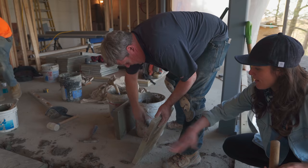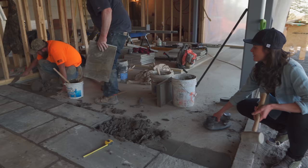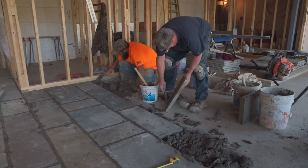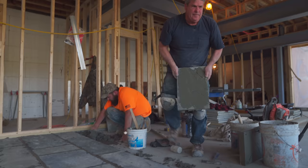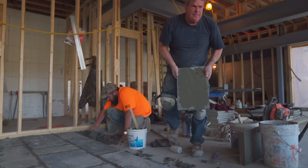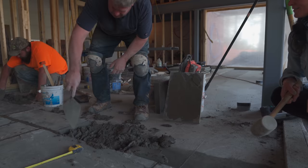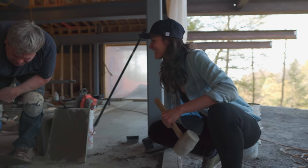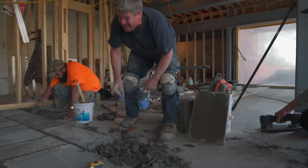Wetting it on the bottom allows it to bond — if you lay the stone nice and dry, it doesn't bond as well to the mortar. What I do is take Portland cement and add it to the water, make a paste — it works great as a glue. I love this tool because it gives the stone a handle to work with, and you don't have to put your fingers down in the mud. If it's a really big stone, you can use two of them.